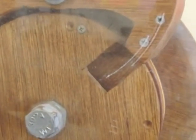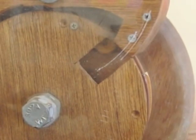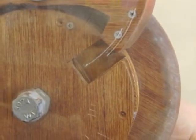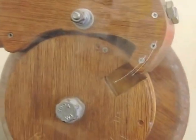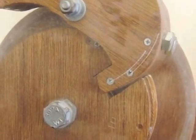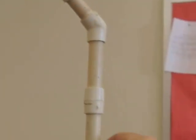So let's go to the back. If I turn my wheel and line up that first cutout — which is right there — then turn the wheel in the opposite direction, just far enough to line up the second wheel with the notch into the correct position, which is about right there, then turn the wheel to the left again, just far enough to line up that notch — we see the pivot arm pivot down, releasing the bolt, and so now the lock is open.